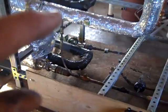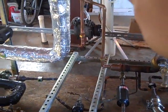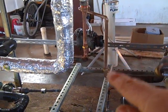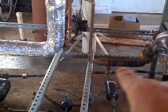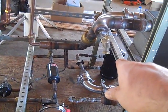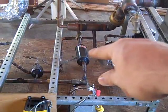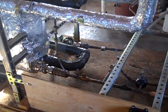The refrigerant will travel from the pump — it's got a check valve in it — through the heat exchanger, where it will boil off because it boils at a low temperature. Then it will travel through to the expander, which in this case is a scroll. The hot gases come out of that scroll, which is running backwards from the way it would run in a vehicle. The hot gas then hits the condenser, cools down, and is caught in a recirculating tank — basically an accumulator. Then that refrigerant is brought through a filter dryer, hits the feed pump, and the loop continues. So it's a continuous 24/7 power maker.